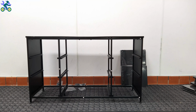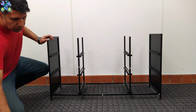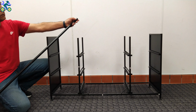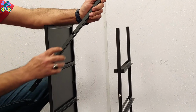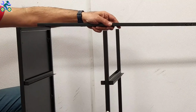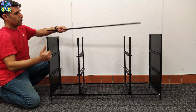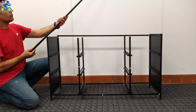After about 10 minutes, I realized that the manual is wrong. If you remember, the upper support bar consists of two parts, 5 and 6. Place the support bar that includes part 5 on the left and part 6 on the right. In this case, the larger hole that is on both sides of the support bar should be facing up, and the connection point between part 5 and 6 should be placed inward. Install the support bar on the left side according to the video. The bolts that are installed in the middle will go into the hole and be hidden.